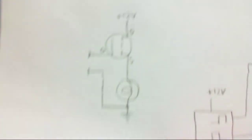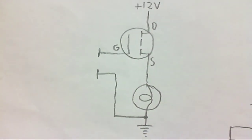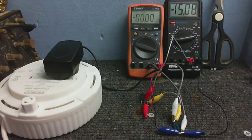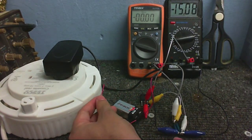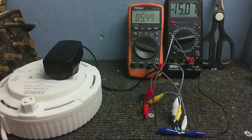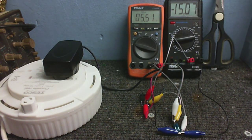There we go. Now we'll move on to configuration number two. The MOSFET is connected in this new configuration, with the bulb at the bottom and the MOSFET at the top, connected to the 15-volt supply. I'm going to connect the battery to the circuit's ground and connect the battery's positive to the MOSFET's gate. And as you can see, the bulb barely comes on at all. We've still got 15 volts supply - that's why this meter's here, so you can see the supply voltage has not changed - but we've only got 5.5 volts going through the bulb.